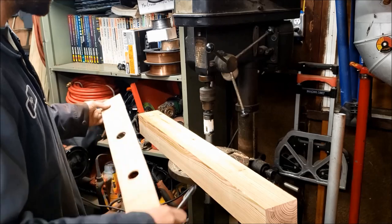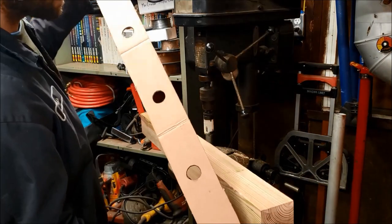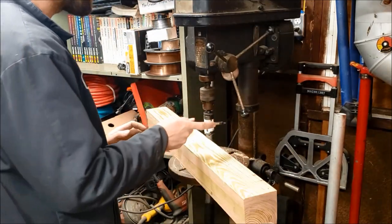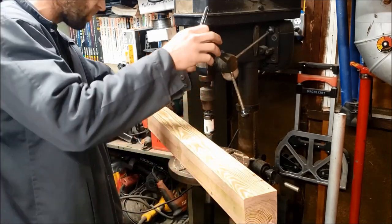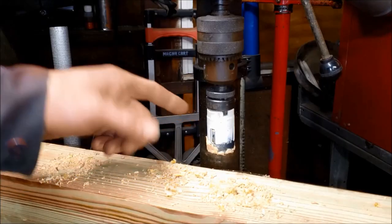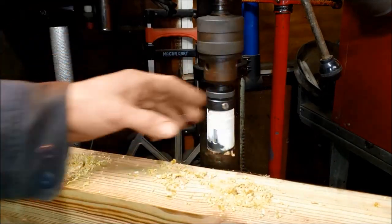To get these posts drilled out, here's the method I'm using. It's pretty time consuming but I feel like it's the most accurate. I have this template cut out and I just mark my holes on both sides. To get a nice clean straight cut started on each side, I'll use the hole saw bit to just get it started. The bit can get clogged up with this sappy wood, so I just take it and get those shavings off.